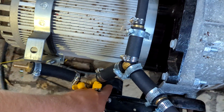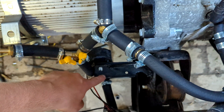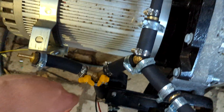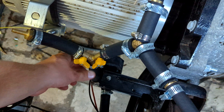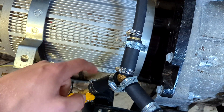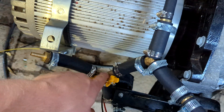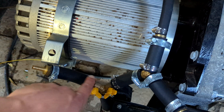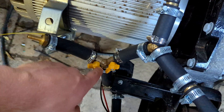Starting off is the Tesla coolant pump down here, which is bolted onto a mount that I made and welded onto one of the transmission mounts. Off that runs the outlet — that's where the coolant flows, so it's this direction. And then here's a Y-splitter; I have two connections off of this, and this is all three-quarter inch hose.